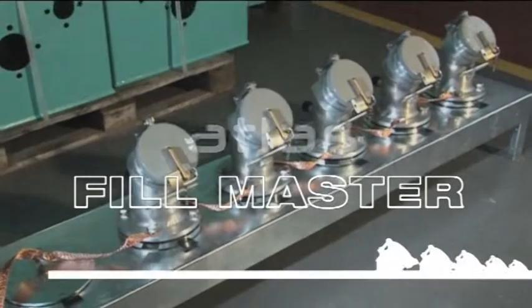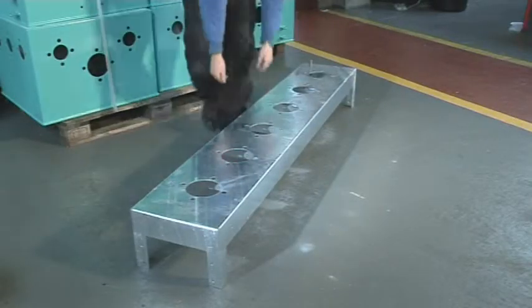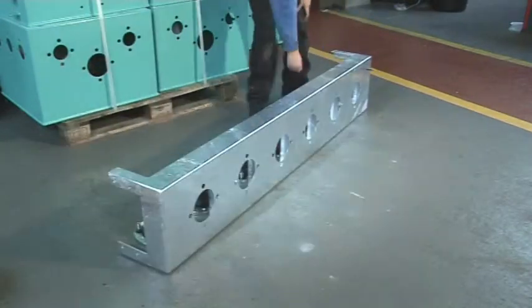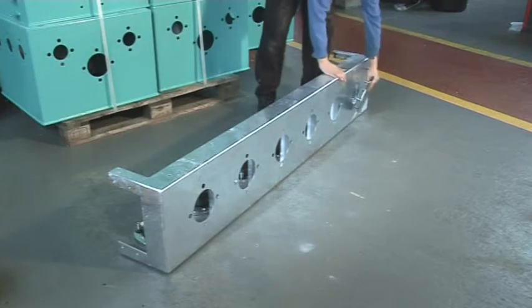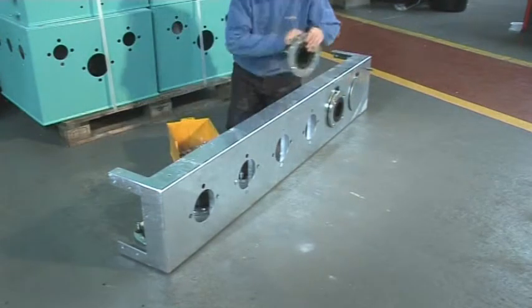Another innovative product from D-Berry & Co. A pre-assembled offset fill system built in-house, offering reduced labour costs and time on site. The base tray is a precision laser cut plate which is folded, welded and hot-dip galvanised for corrosion protection.